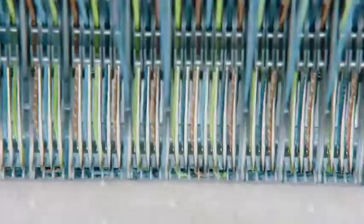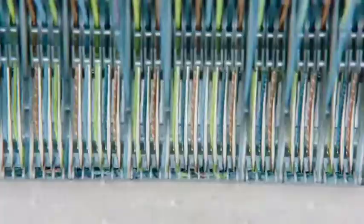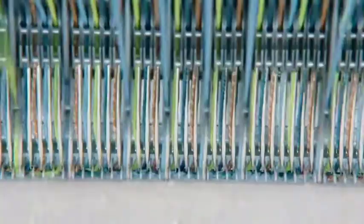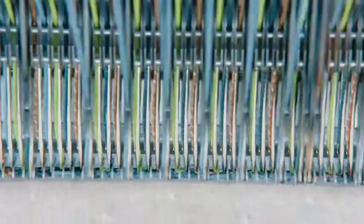In this way, all four colors can be tufted where needed in that pile row. Then the primary backing moves forward to the next line, and the needles do the same thing while shifting in the other direction. That's the Colortec machine.